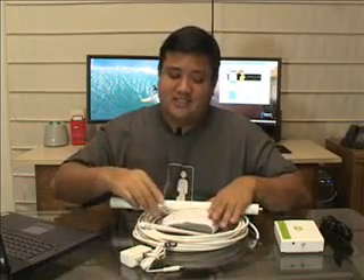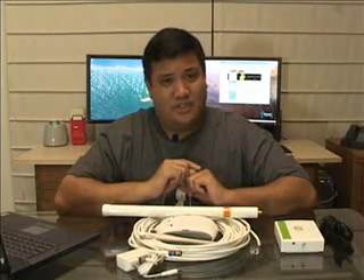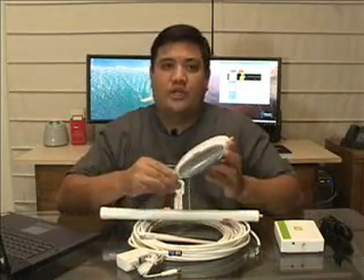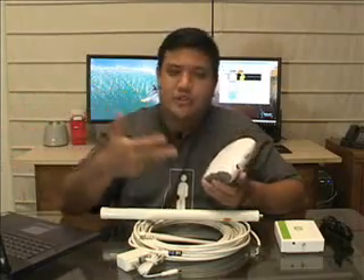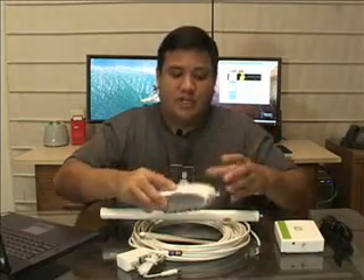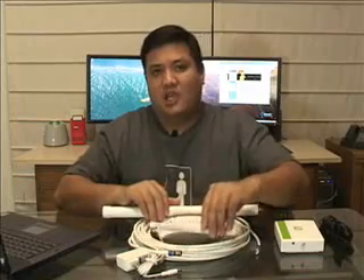The downside is that this is quite expensive. The YX-510 is $399. If you wanted a unit that only supported either the 1900 or the 800 band, that's $100 less at $299. But as long as you're going to invest in equipment like this, I would suggest you get the higher-end unit because it supports multiple users, so you don't have to worry about someone using up your repeater. And if you ever change carriers, you might find yourself with equipment you can't use.